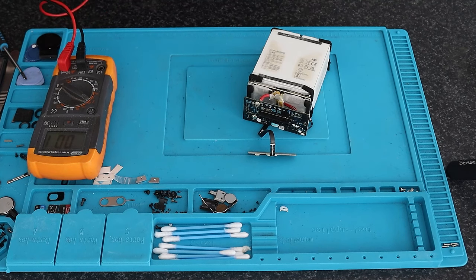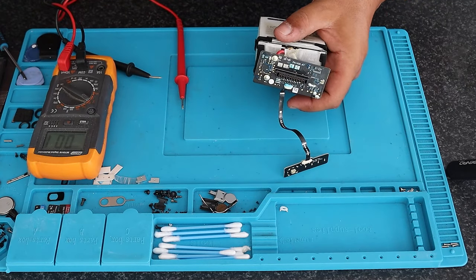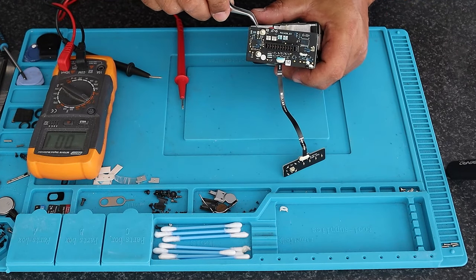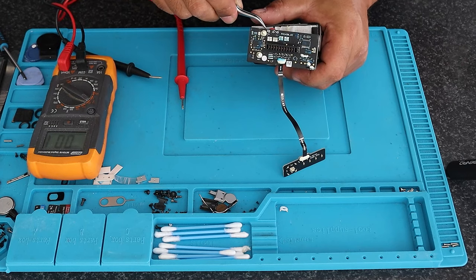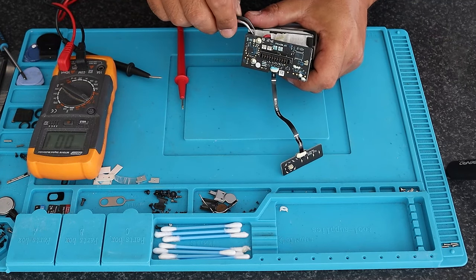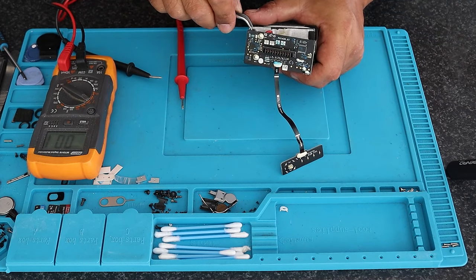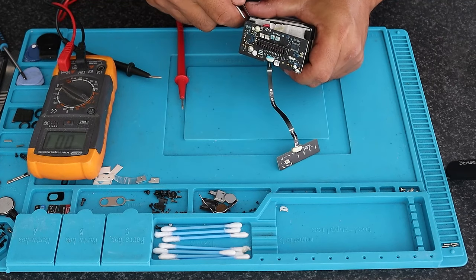After individual cell testing, I'll make up a jig that allows me to plug it into my power supply, to give each cell a small concentrated and well-timed boost — low amp, very low amp — at the rate of voltage that the cells require. This is all 4.2 volts nominal.